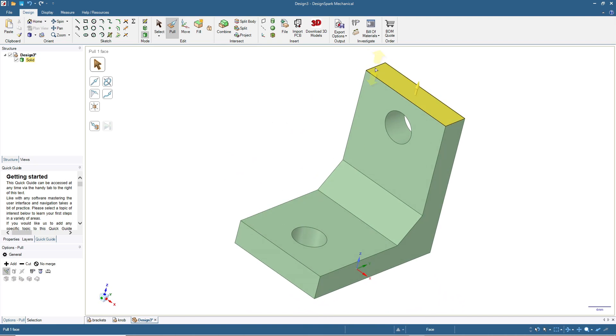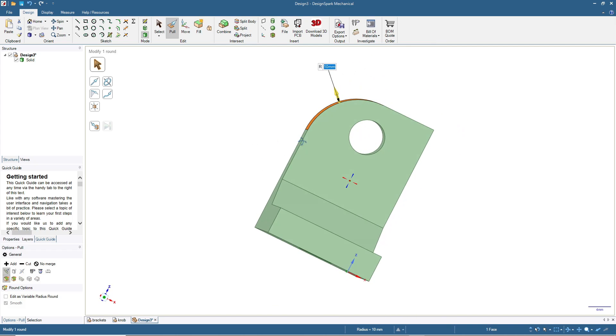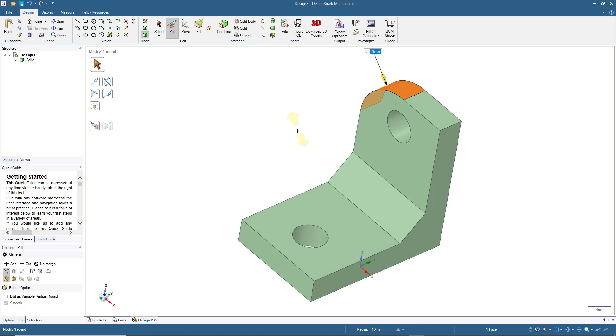Click the edges one by one — this one, this one, the left bottom — and select Round for the edges. Pull and set the value. Ten is too big, so let's use five. Set each edge to 5 millimeters: this one, this one, this one, and this one. Now we will add some more detail to the holes — we want to add a chamfer.